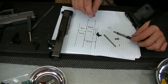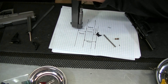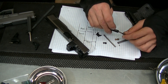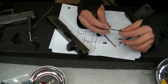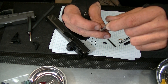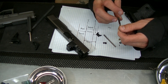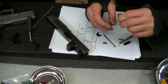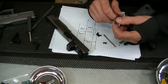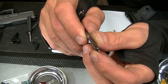We have an extended lightened skeletonized striker, like I thought. Taking the spring off so you can all see this. When I take a gun in and look at a striker, the first thing I'm feeling is right here on the striker lug face — feeling for burrs or anything like that. Right here on the end edge I can feel quite a bit — that's going to cause a problem with the break. I could feel that when I was pulling the trigger as well.